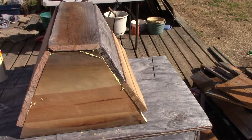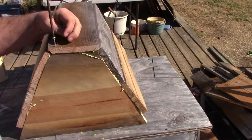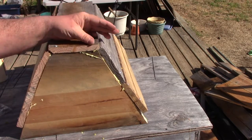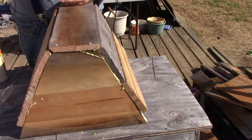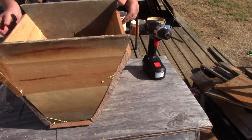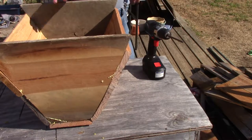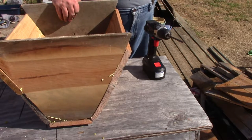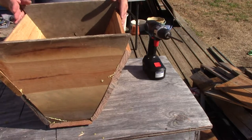And come up and do this front corner, caddy corner or opposite from the other one. Down in tight. Another one across from it. All right. Looking good. For the next stage in this project, I'm going to need to get my table saw and my miter saw out, and I am going to slice boards down to the proper width, and then, after they're cut to the right width, I'm going to use the miter saw to cut them to the right length so that I can put top bars in here.